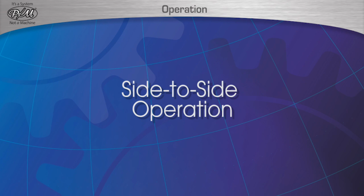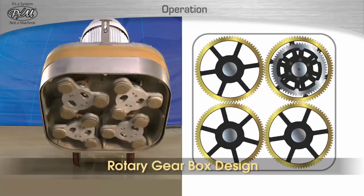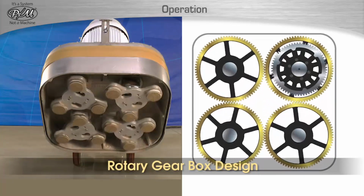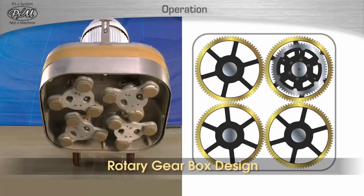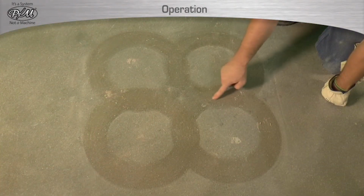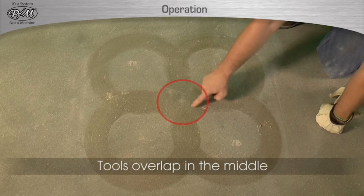Side-to-side operation. The 3030 and 3025 PM machines both feature a rotary gearbox design. This means that at any time the machine is running, there will be two grinding heads turning clockwise and two grinding heads turning counterclockwise. Also, because of the rotary design, the center of the machine will have an overlapping of tools, which causes the center of the machine to do more cutting than the outside edge.